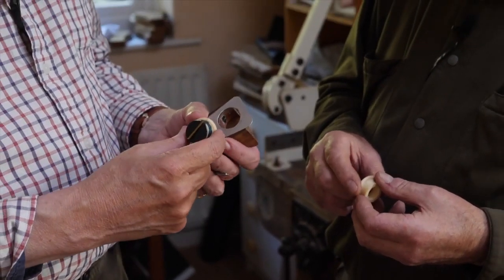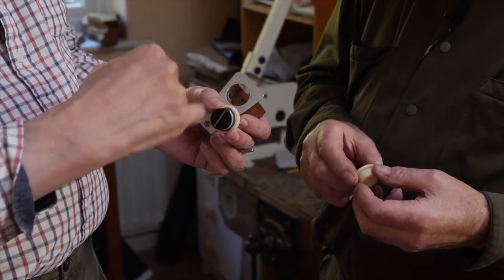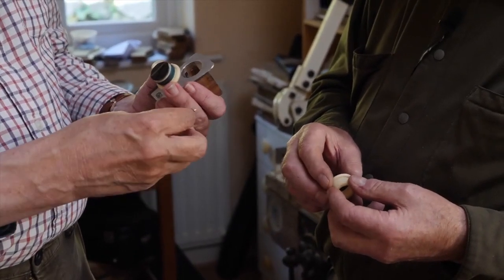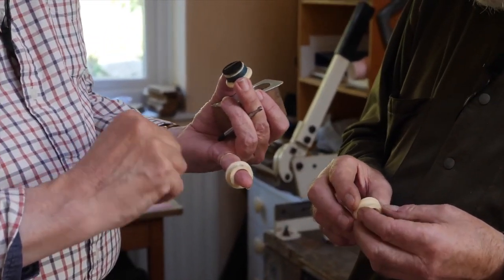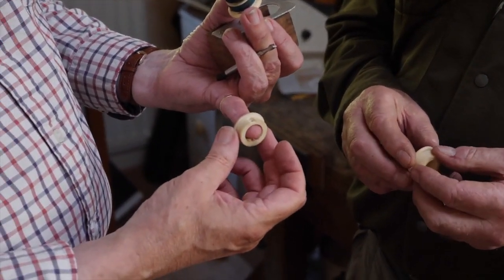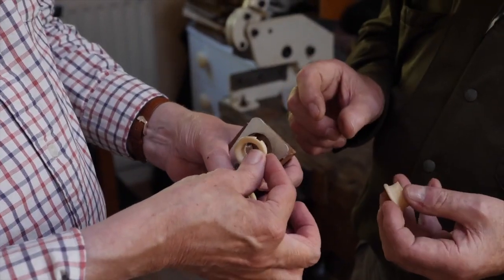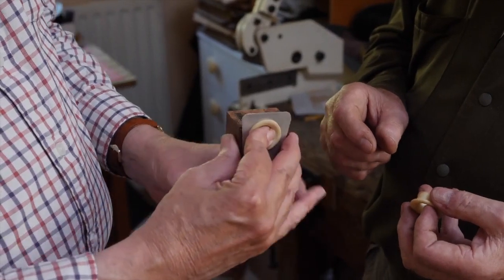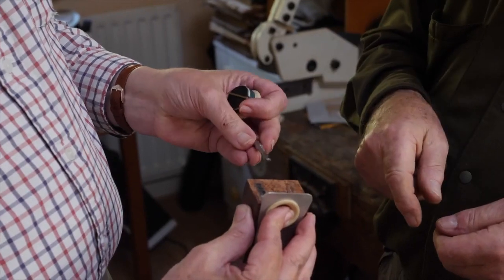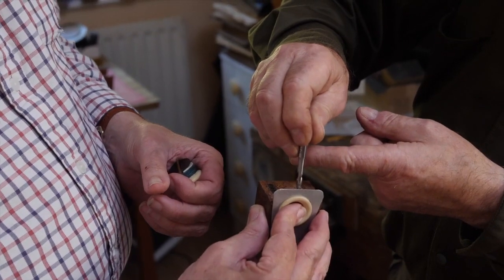One further thing on the bellows inlet: quite often I've seen people flatten the top so that you can bind the leather in, but you've got a different way of doing it, haven't you? You cut a slot in here? Yes, it's neater and I find it more satisfactory, and it's quicker as well. And the way you do that is you've built this jig, it fits in here, that goes into your milling machine. Just push it against the milling cutter, and the cutter is like that.